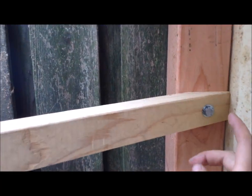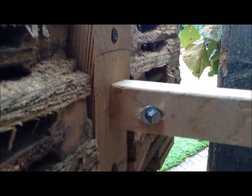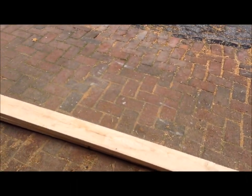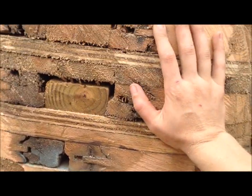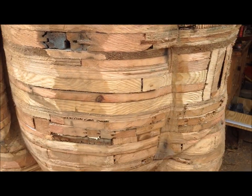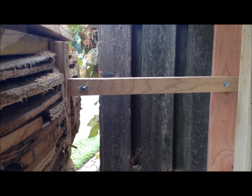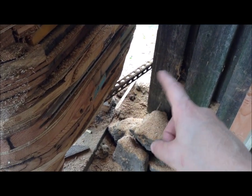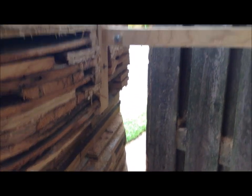There's that piece connected with some lags through here. I've cut these at an angle so that they fit flush against these pieces. I also removed that other brace as well as the 2x6s holding this up, and this was fairly sturdy before I did that, but even with that one brace, if you push on this with all your might, it barely, barely, barely moves. That one brace done properly is stronger than the four or five I had up here. I could probably get away with just one, but just to be on the safe side, I'm definitely going to put one exactly the same way by the bum, and then I could remove the one that goes underneath the legs.